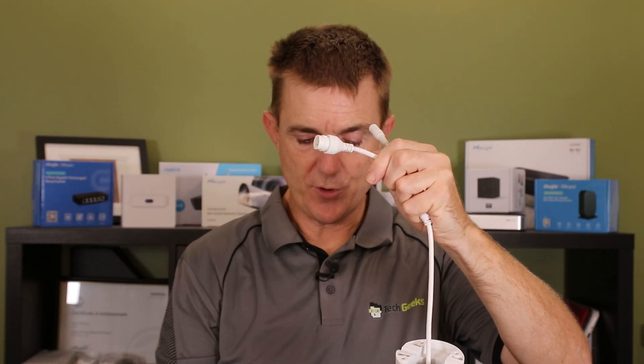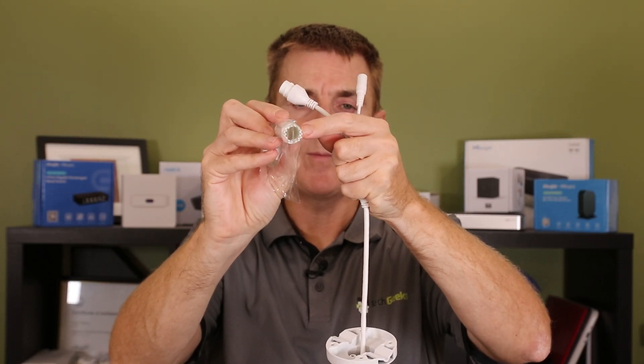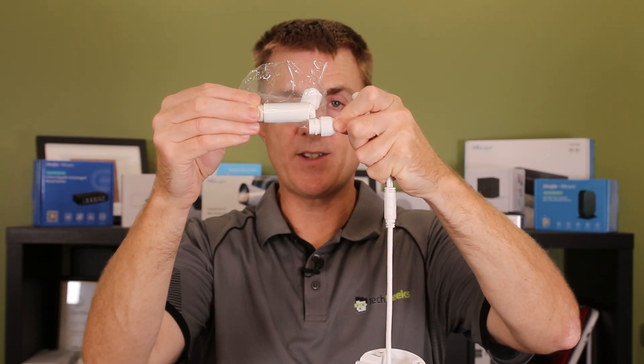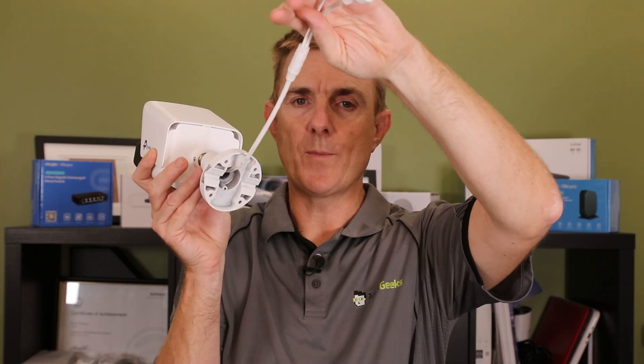This is the bit that's going to be exposed — you're going to have brought a cable out of the wall to this point. You may decide to put this inside a junction box to keep it watertight, or you can use this waterproof connector. Your cable passes through it neatly and locks into place with the camera to create a waterproof seal. I'd probably still put some tape around it, but that creates our seal. If I was mounting this outside, I'd also create a drip loop so that any water runs down the cable and drops off the end rather than running into the connector.